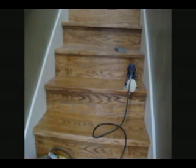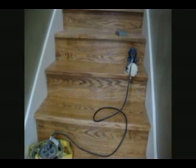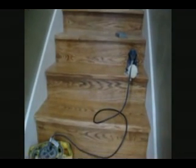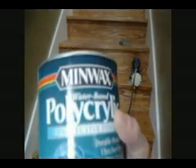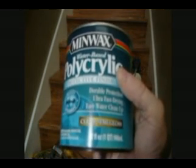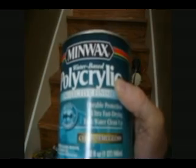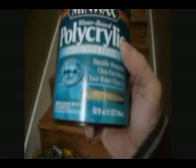You can see the transition from the carpet to these beautiful oak steps. This is native wood that I had milled, cut, sanded, and installed in my house. The product I'm using is Minwax water-based Polycrylic — it's a protective finish. What I like about it is that it doesn't stink up the whole house and it dries very quickly, and it's water cleanup. You can get it in gloss or semi-gloss. I found that one quart was plenty to do two coats easily — maybe even three. This is what I recommend if you want to get the same professional results.